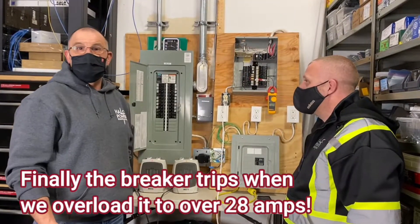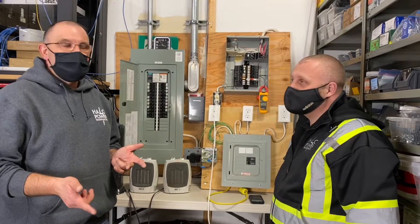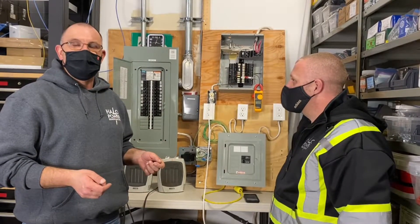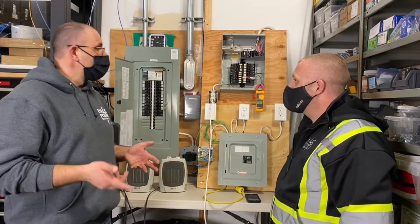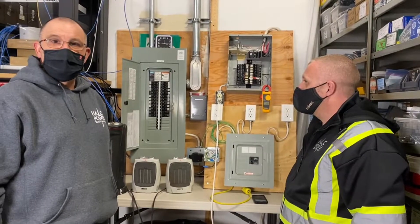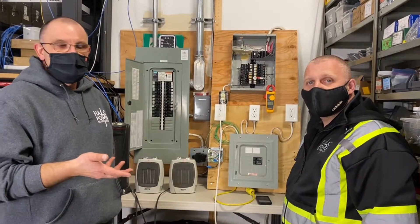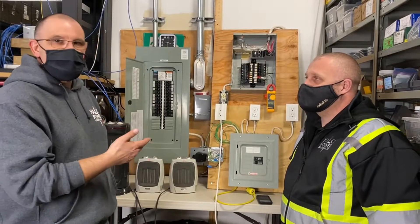If you're looking to do a little bit of research on your own about the Federal Pacific and Federal Pioneer panels, I encourage you to Google them. You're going to see that the problem with these breakers is that when they overload, they don't trip. The other problem is a short or a fault to ground — again, the breaker won't trip. We've actually seen situations where a nail or screw was pierced right through a cable in the wall, melted the screw, and the breaker still didn't trip.